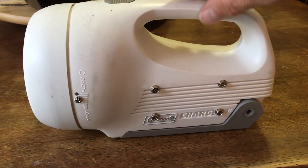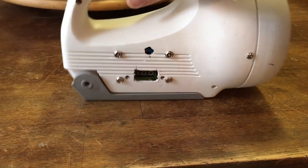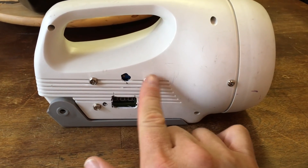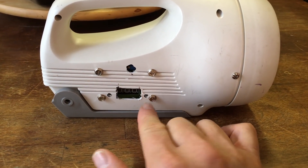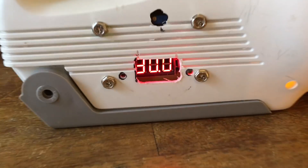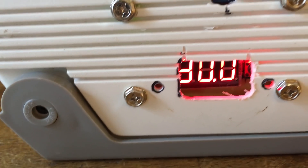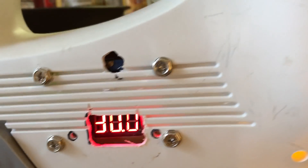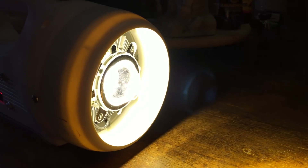As you can see, here are my mounting screws for my components. I also drilled a hole on the top and a couple of holes for the buttons for adjusting voltage in and out on the buck converter. As you can see, I now set it to 30 volts, and you can see the little pot there to adjust it — it's much brighter now. So 30 volts seems like the sweet spot for the LED.